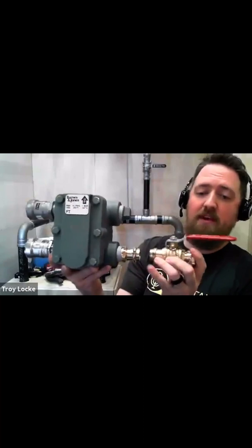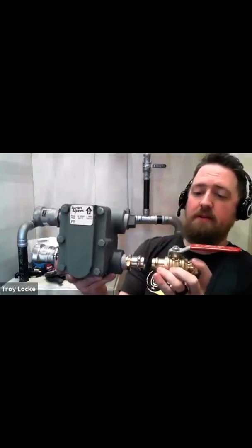Because you are using 304 or 316 stainless steel material, you won't have any issues with corrosion and failure. On this side I just have a bronze fitting for service — same thing as a service valve. This is how you can test your steam traps: you can have a bronze adapter and put a ball valve here to make sure the steam trap is working. Some individuals will specify vents on these as well. Just follow the layout and design depending on the manufacturer — we don't manufacture steam traps, just the fittings that attach to all these accessories.